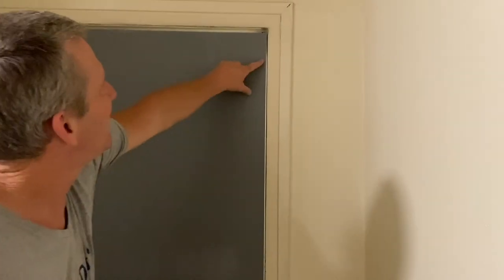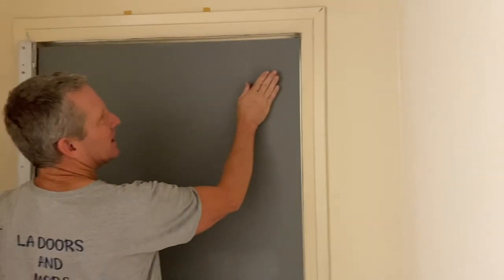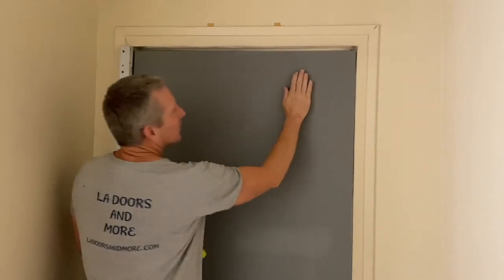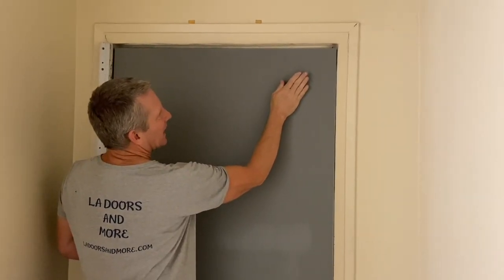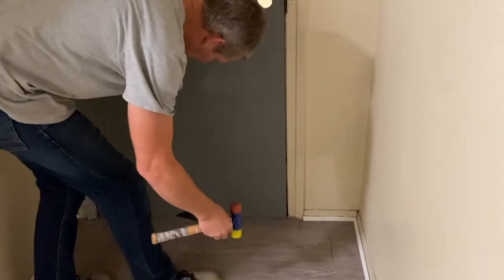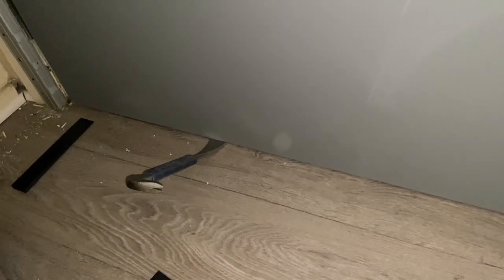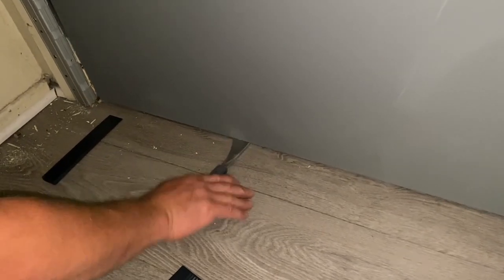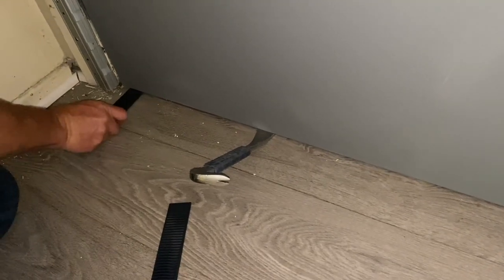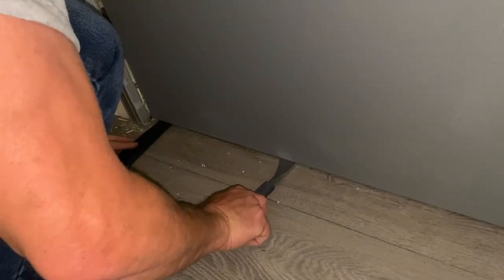Obviously the door needs to go up — it's rubbing here but not there; the door is actually going at an angle. The good news is I still have plenty of room to move it around. Since the door is going like that, I want to kick it to correct it. The first thing I want to do is get it up off the ground, so I'm going to put a wedge underneath here. Knowing I'm going to have to lift the door up, it's best to put it in place with some sort of pry bar. I'm going to start over here at the hinge side and get about a quarter inch of space underneath there.